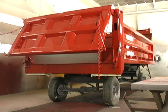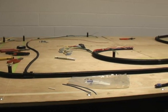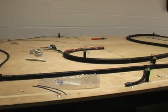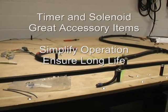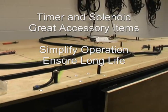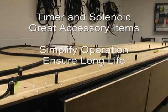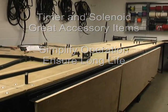The electrical wiring of the vibrator can be run separately or as a part of a whole truck wiring harness. Very often, the momentary switch for the vibrator located in the truck cab will be connected through a solenoid and possibly even a timer. The latter is a useful accessory to ensure that the driver does not accidentally operate the vibrator on an extended continuous basis.